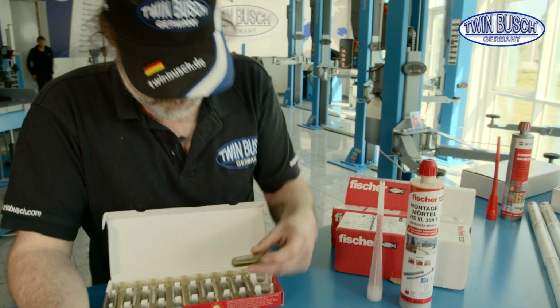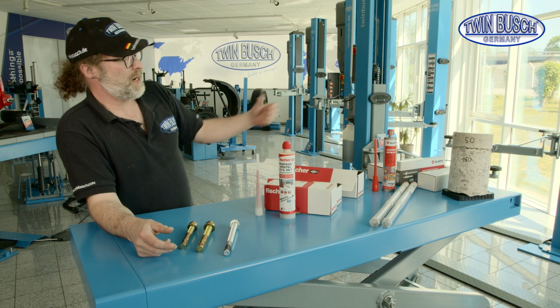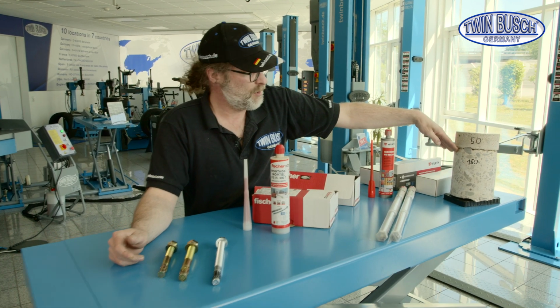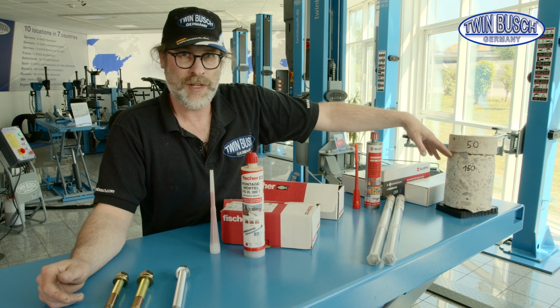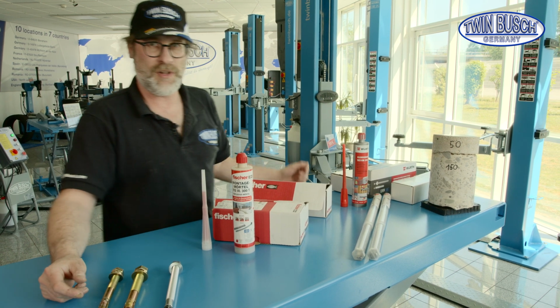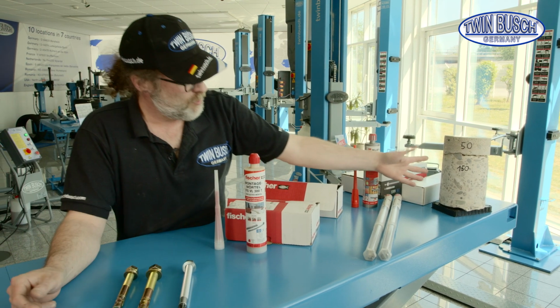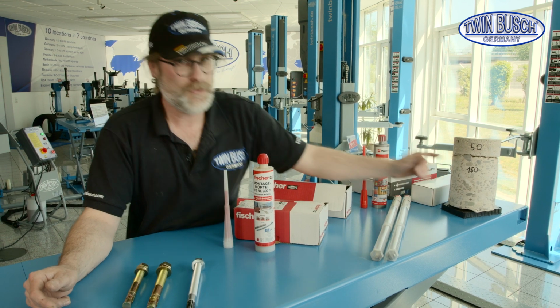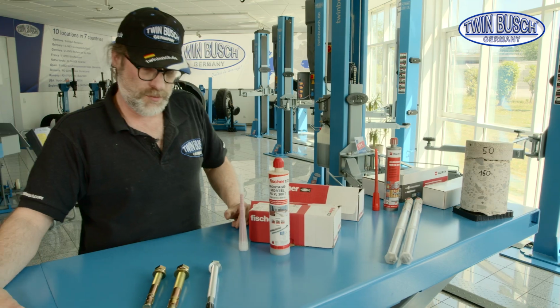It's hard to judge. In this client's case we set up the reinforcement plates. Using reinforcement plates, the required foundation thickness is reduced by 5 centimeters. The client didn't need to build a new foundation. The 15 centimeters are enough in conjunction with the reinforcement plates.